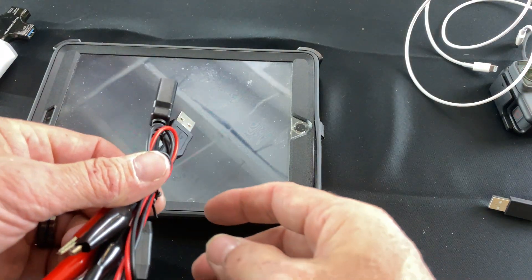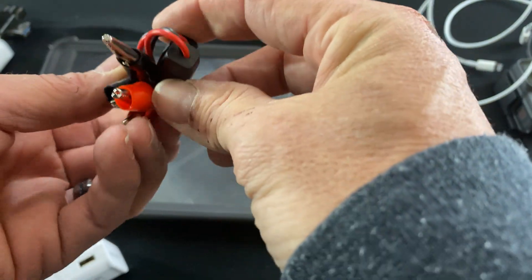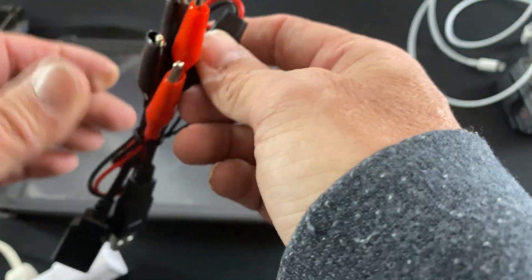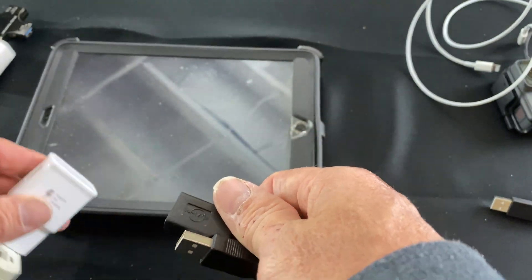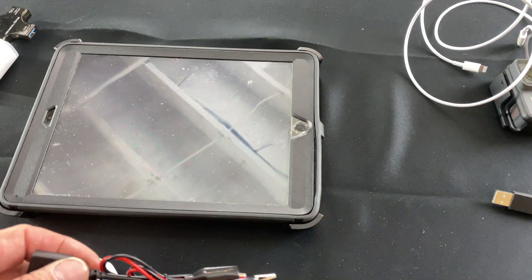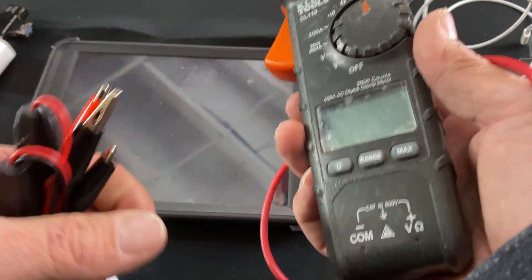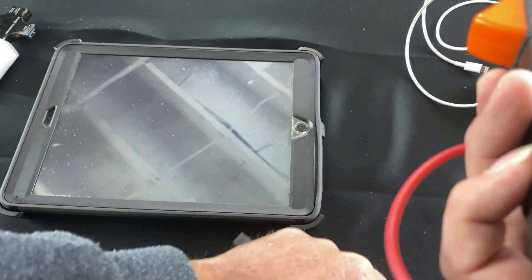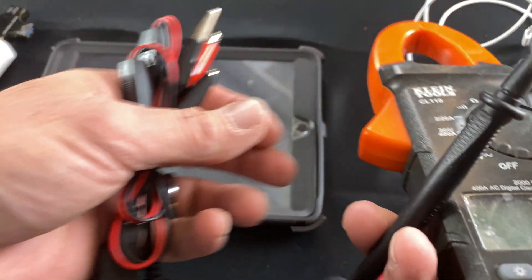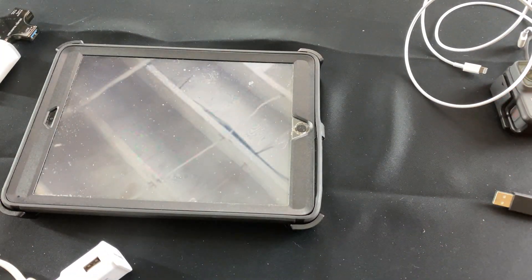You can actually just see whether or not it's drawing the right power for your device. It also comes with these accessories: USB male, USB female, and alligator clips. So technically, if you plug this into your power source — regardless of what it is — you can grab your voltmeter and plug it into these alligator clips, clip them onto your leads on your voltmeter, and actually test whether or not your power pack is bad.